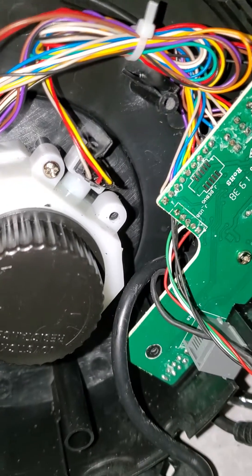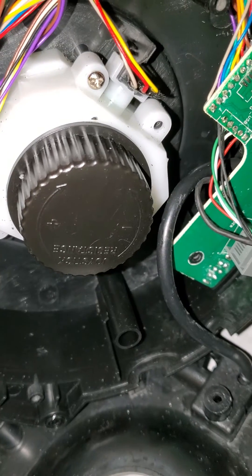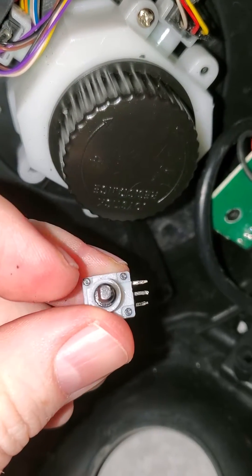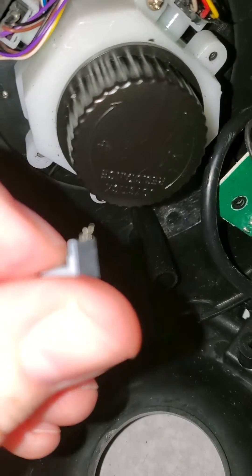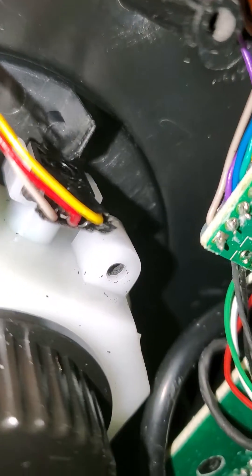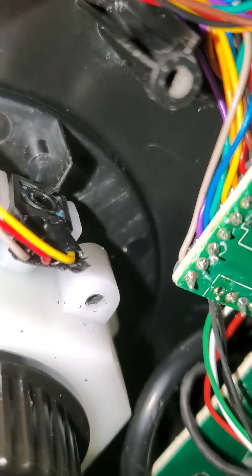This is a follow-up video, hopefully the last follow-up to the HOTAS one repair. I've cleaned it so many times I finally took out the original potentiometer completely and put in a new one. Instead of hot glue I just put electrical tape in between the leads and then wrapped it around as well, and it fit pretty good in there.